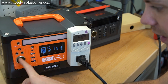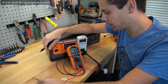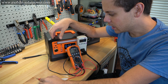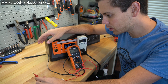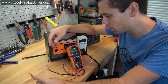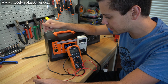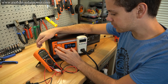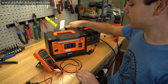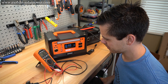Because the battery is under load, let's test the output of the 12-volt receptacle to see if it's dropped — we have 11.2 volts. That's a bummer, I guess it's not regulated. I don't know why the voltage was so high before, because the nominal battery pack voltage of this unit is lower than what we got initially. It might be a regulator where the input determines the output — if the input is low because the battery is drawing power for the inverter, the regulated output will decrease. And then — we pulled a 500-watt load for like 10 minutes and it cut off. That is pathetic. I am not impressed.